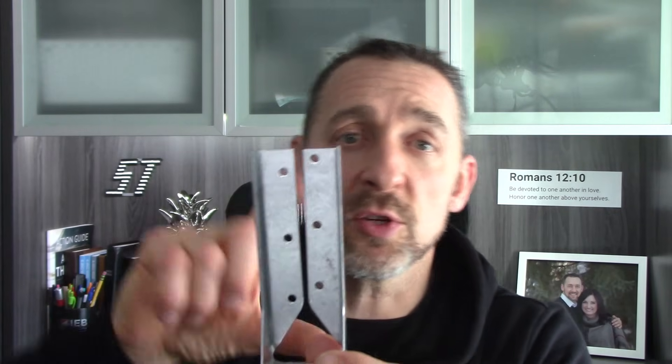There is a way to fix this: they make devices with concealed flanges where instead of the flanges being on the outside, they're on the inside. You might wonder about the nailing pattern since there's no cross-shear nailing. On a standard hanger you have four nails going straight into the ledger board and four going at an angle. With a concealed-flange hanger you get six full-size nails going straight in, which is supposed to be the equivalent strength. So there is a proper way to address the end of a ledger board.